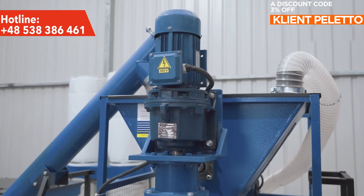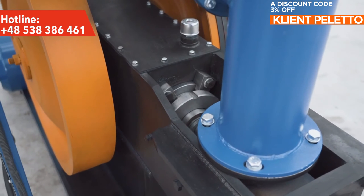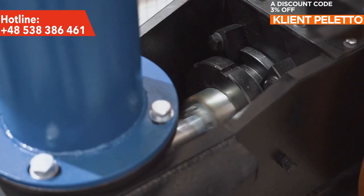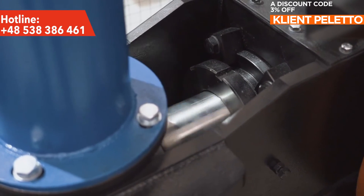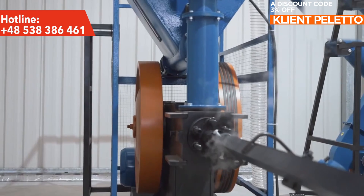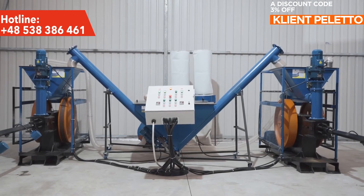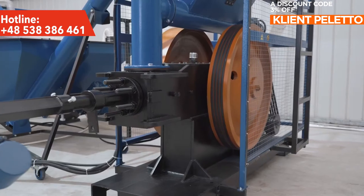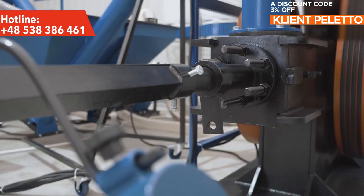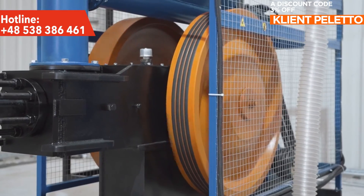When the hammer retracts, a chamber opens in which a vertical screw compacts the raw material, and then the hammer of the impact mechanism presses the material into the matrix. Because the chamber has internal taper, the material is subjected to a high degree of compression. The future briquette heats up due to internal friction and interaction with the walls of the matrix. To ensure additional compression of the briquettes from the pressing chamber to the cooling line, special loads with a pressure regulation system are installed.